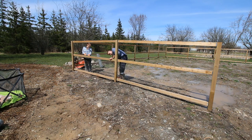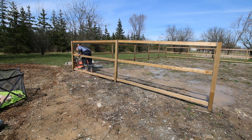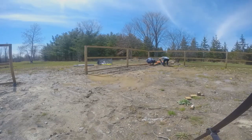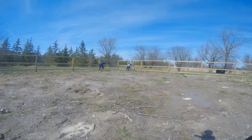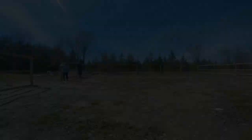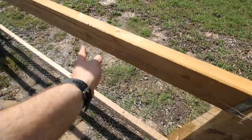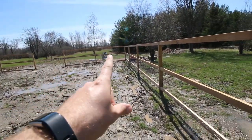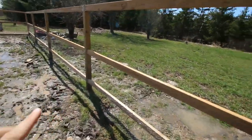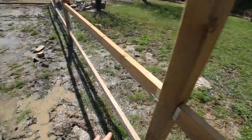So, start at the top here, you're thinking? Yeah, and then go all the way down. We're off to the races. My wife and I just rolled out 100 feet — they're 100 feet long, 24 gauge chicken wire. Like I was saying, we went around — I'll show you guys. It's really tough to see this chicken fence, it's so small. Went around, it's really easy with two people. Rolled it all out in 10-foot chunks. My wife pulled it tight, I stapled the top. Then I came back and pulled down and away and stapled the bottom to keep it decently tight.